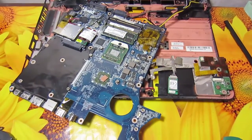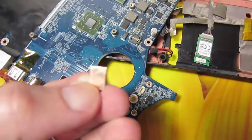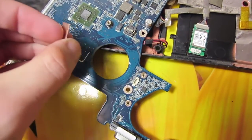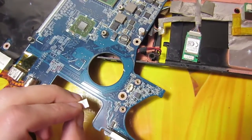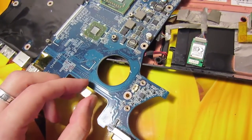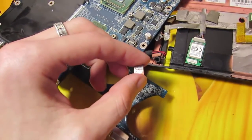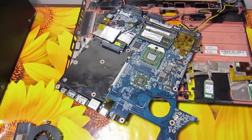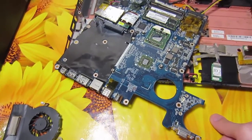After the first look, we can see this copper board. I don't really like this stuff. Where there is a thermal silicon pad, you shouldn't put any metal because you can crack or fissure your crystal on the BGA.